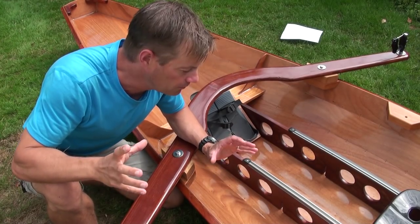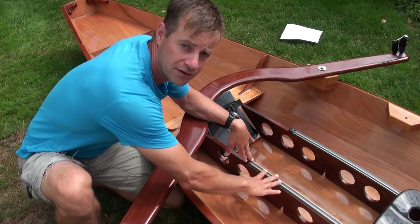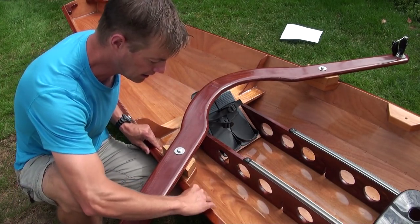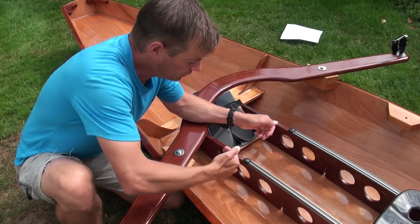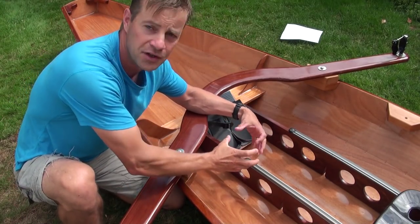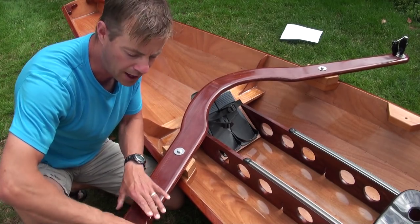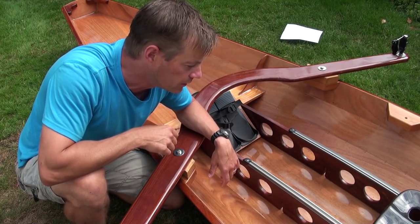The way we've been able to make this so light — only 14 pounds — is by using the boat itself as the structure providing all the support and stiffness. The sliding seat frame weight is conveyed directly down to the hull where it makes contact, and the riggers are affixed to the gunnels in the boat, providing stiffness so you don't get any flex. People have tried unsuccessfully to create a one-piece unit where the rigger curves off from the frame, but there's simply not enough support and wood flexes a lot more than metal — which has given wooden systems a bad name.